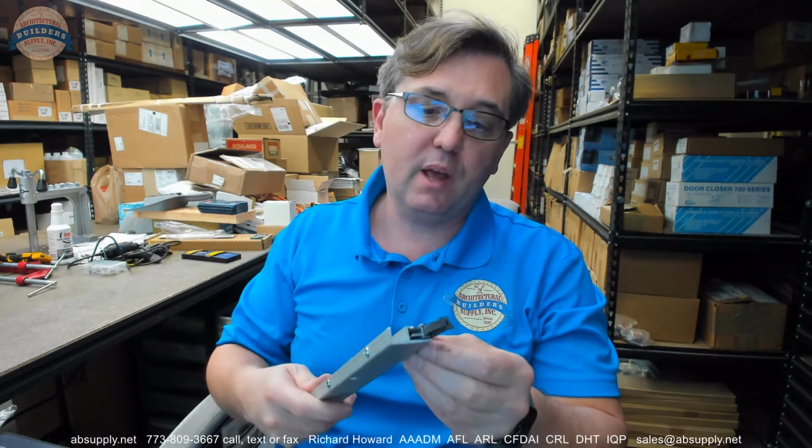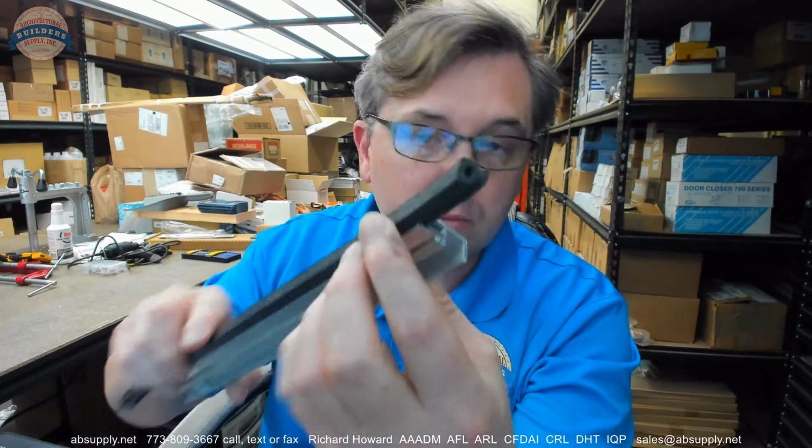And another hallmark of silicone is not only its resiliency, but a defining characteristic would be its ability to handle extreme temperatures. I mean extreme, like 60 below to 400 above Fahrenheit is where silicone is going to be really well suited while maintaining flexible. So when you need a confluence of flexibility and extreme temperatures, this is great. I would certainly use this over neoprene in practically all instances, except if absolute stopping of water intrusion was paramount.